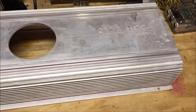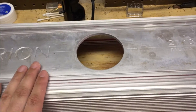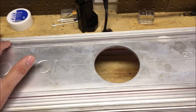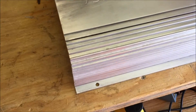Here's the 2100 — as you can see I got most of the anodizing off, there's still tinges of red on it. The Grease Lightning would probably work a lot better on something that's less deeply anodized, but I had to use Easy Off and I had to use it a lot longer than I wanted to. You can see there's some pitting on there that I'm gonna have to sand out. There's another method — lye — I'll put a link to a video showing how to do that.